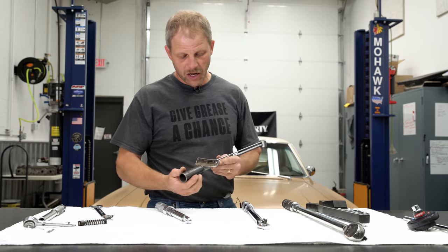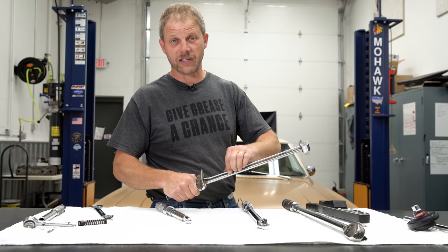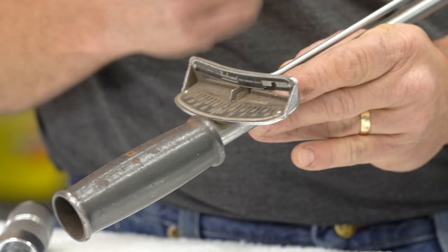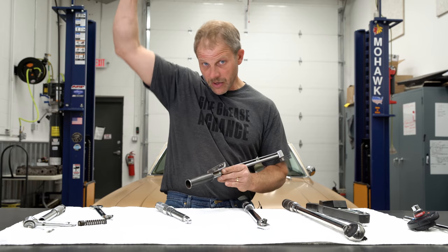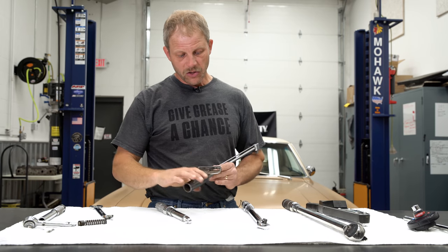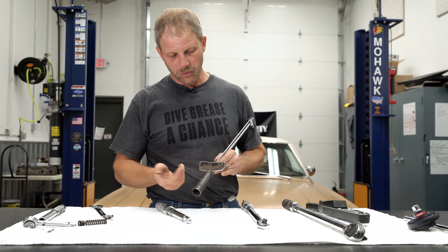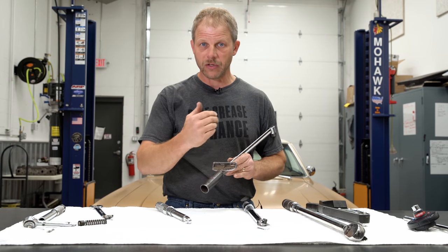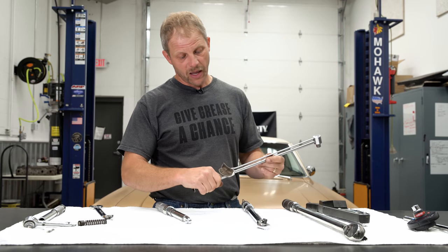This works when you don't have anything else. However, the issue is if these aren't treated really nicely, this beam not only deflects when you're using it, but it also deflects when you throw it into storage, and it can easily become damaged. And two, you have to be able to see this — you cannot have it in some obscure spot where you're waiting for it to bend or give you some tactile feedback. You have to have a visual on the gauge. Its accuracy also is not that grand. If you're within five foot-pounds, you're fine, but if you need one to two foot-pounds of accuracy, it's not going to work very well. But it definitely has its purpose and some functions.